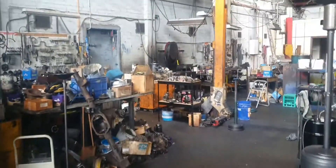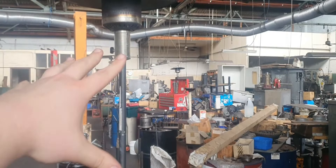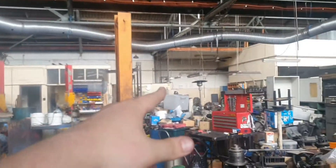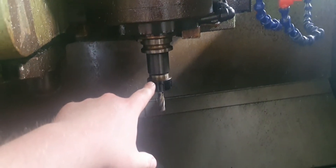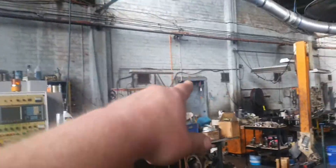It's a bit hard to see because it's a bit dark in here, but that light turns on. That's a 14 by 1mm pitch tap we're doing. We get the BMW diffs, take them out, machine them off - because BMW weld the crown wheels onto the carriers instead of bolting them on. Dad machines them off and grinds them. Then I put them on here, run the program - a carbide 12mm 4-flute comes down, does the holes, does the counterbore, then the tap comes in and taps them. Then we put them on the Quaife LSDs. We just did one a couple of days ago for Southern BM.